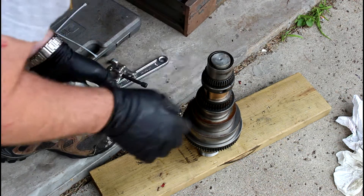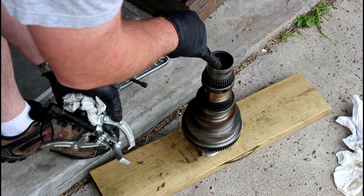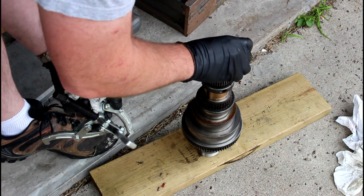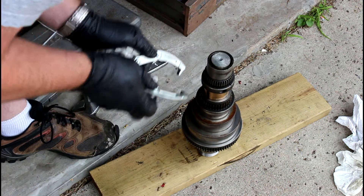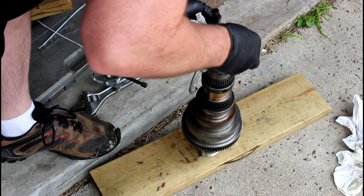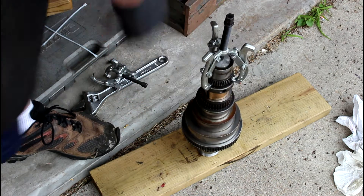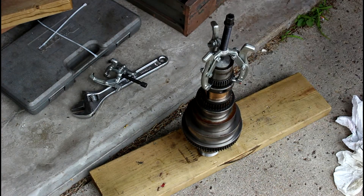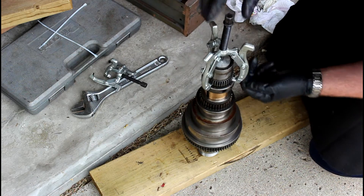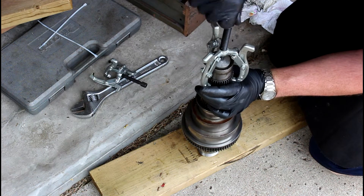I tried a little one first, ground it, and that wasn't big enough. What I got here is an aluminum plug because I can't push on the outside — I've got to push on the inside. That guy fits nicely in there. I put some Kroil on this gear here to help it off, and I'm just going to set that guy on there and hopefully it pulls right off. Make sure your jaws are all the way in as far as they will go.